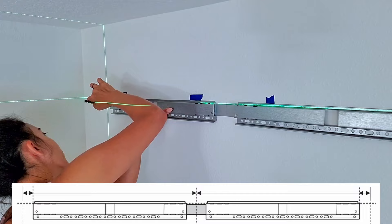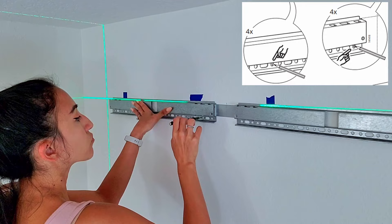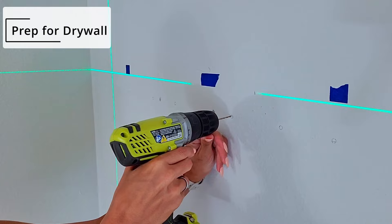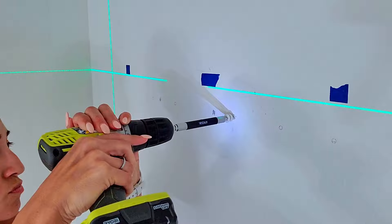Since I have upgraded my screw hardware, I'm making two holes per rail with at least one hitting the stud. I like to drill a pilot hole first with a small drill bit, then open up the hole with a 3/8 bit for my anchor. Using a hand screwdriver to tighten is recommended, but I use my screw gun at a low torque setting.